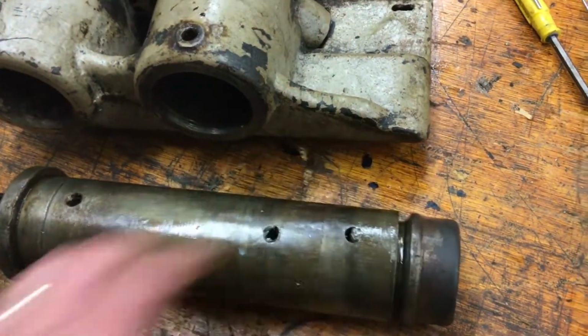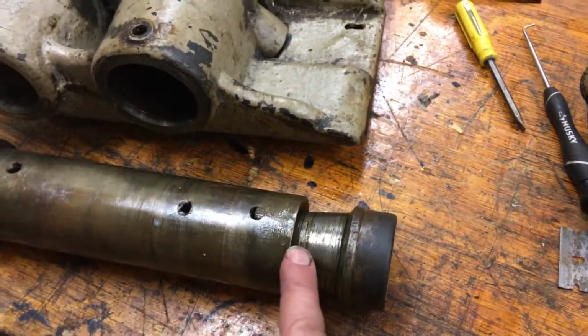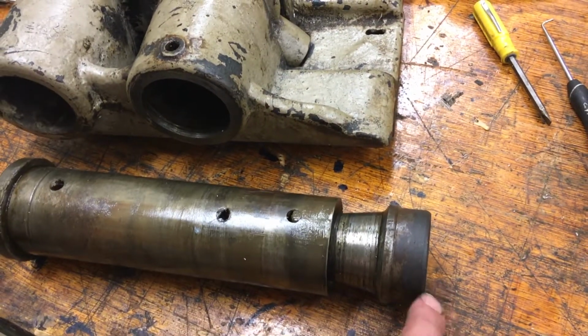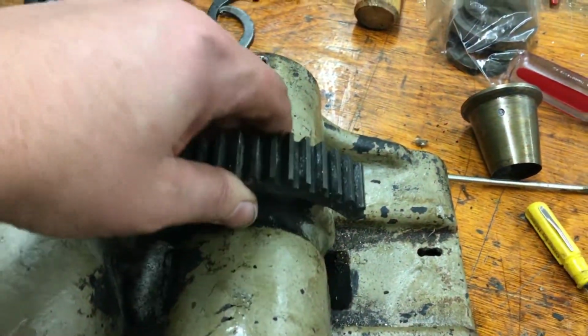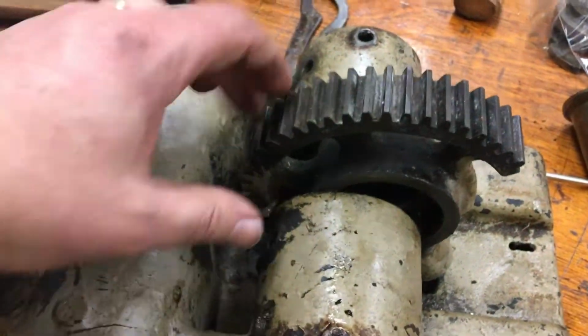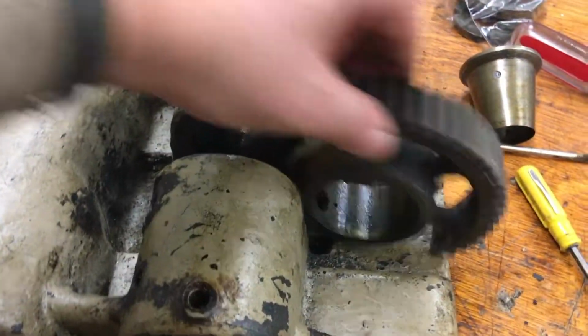You turn the spindle around, put it in the other way. See, it usually would have been in this way. You put it in this way, and now you can just use your press to press it right out. And the reason that was obvious was because how would they have gotten this guy in here if there wasn't something in the middle? So now we know.